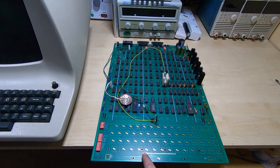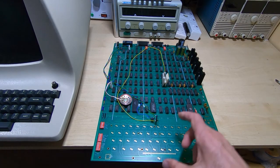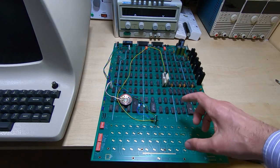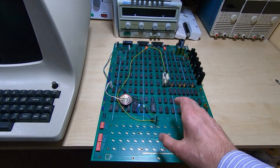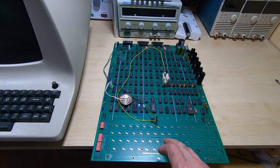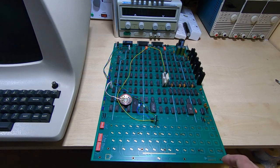One further change is adding another keyboard connector so if you can't find the original keys, I'll be producing a small add-on keyboard PCB - or you can produce your own. It's a simple matrix layout. I've included the options that were with the original, and that includes a connector for an external numerical keypad, which replicates the keypad functionality of a more modern PC. It's an add-on module that plugs into this connector.